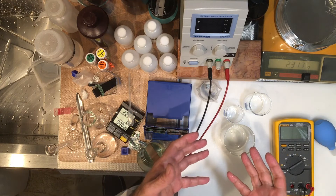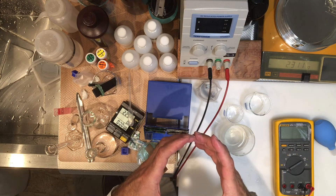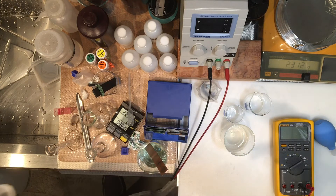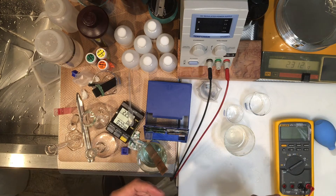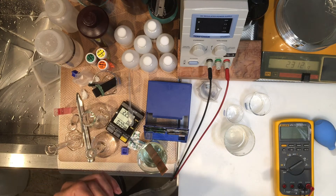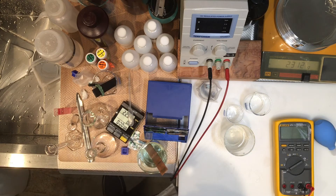If the chlorine is too low, the unit electrolyzes the pool solution again, pumps it back to the pool, and brings the chlorine level back up. This is chlorine production on demand — only if necessary — so you don't over-chlorinate the swimming pool.